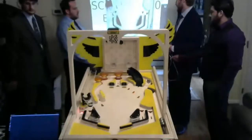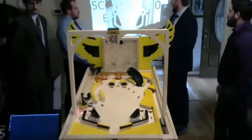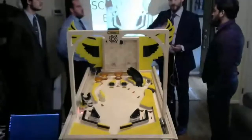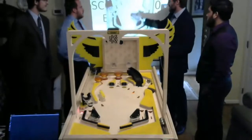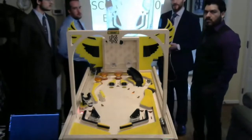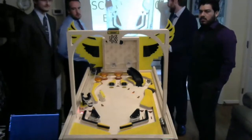And that's done by HSV color thresholding. So it identifies where the flippers are and automatically places a flipping area where the flipper rotates. At the extent of the flipper's range is a circular radial zone. Then there's a couple of tweaking parameters that we can tune to place it on the exact spot that we want. But basically, if the ball is identified inside of the flip zone, then I tell it to flip. Like I said, unfortunately, I wasn't able to implement any sort of velocity control or other stuff like that. So yeah, that's how that works.